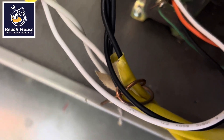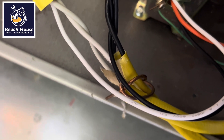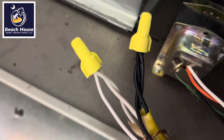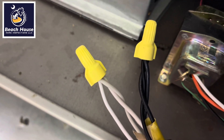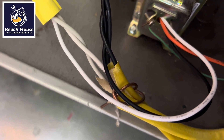Look at the ground — how this unit is grounded. We have one ground conductor just laying on top of the other ground conductor. It's not twisted like the hot and the neutral. You think that's going to come loose when this appliance vibrates?